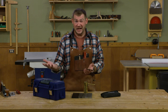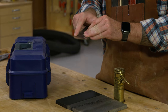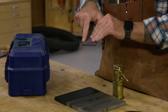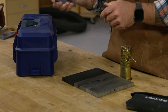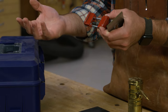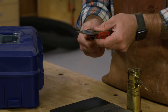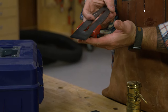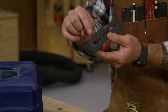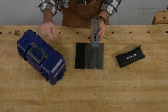You can do this with a couple of different methods. What I do, just because I find it faster, is freehand sharpen. I rock the heel of the chisel or plane iron on the stone until I feel the reference of the bevel, then sharpen freehand by locking my elbows and wrists at the proper angle. However, many manufacturers make honing guides, which simply accept the blade, you tighten it down, and it gives you a reference wheel to ride on and keeps a consistent angle. Either freehand sharpening or using a honing guide works perfectly well across waterstones, oilstones, and diamond stones.